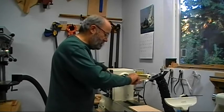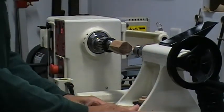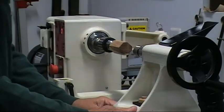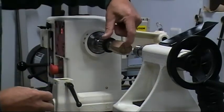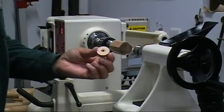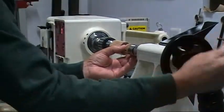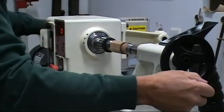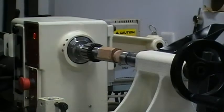Get it good and tight. Now we'll slide the tailstock up for some added support while I'm doing the rough turning and getting the blank into a round shape — that gives us a little added insurance so the blank doesn't come flying off the lathe. I made this little wooden piece so the tailstock fits into that hole and I can crank it down against the blank. It holds it nicely but doesn't make a mark on the end of the blank, so when I want to shape that end later I don't have to worry about removing a hole.